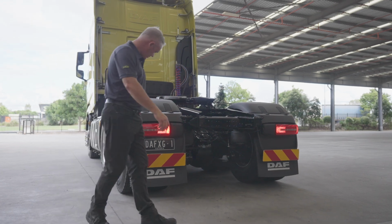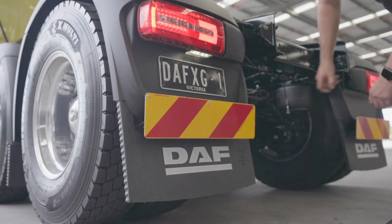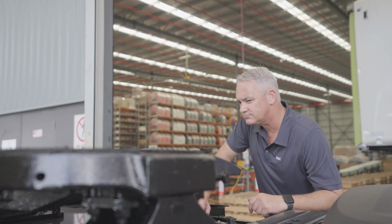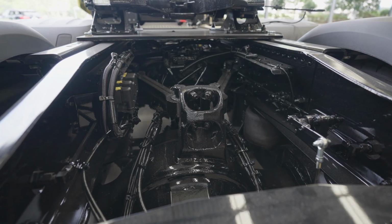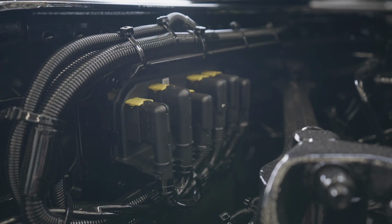At the rear of the vehicle we can inspect for damage and checking our lights is easy once the system check has been started. Trailer turntable or fifth wheel can be checked for obstructions, adequate grease and serviceability. Driveline components and inside the chassis can be checked to make sure there are no obstructions, faults or damage that should be reported and fixed. If a trailer is coupled, we can visually inspect the turntable jaws and the position of the locking handle.